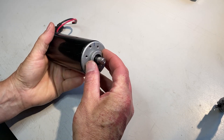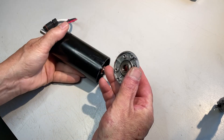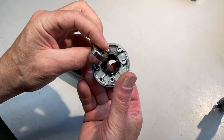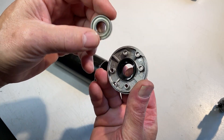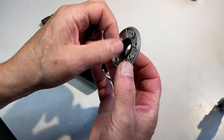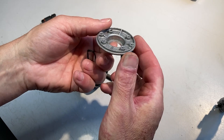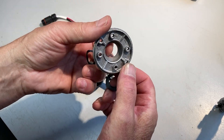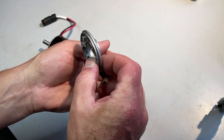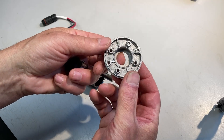I dismantled the spindle to have a look at it and it's not good. It's got one little spindly bearing that has a preload washer behind it that rests against a rubber boot, inside an unmachined casting that's about as thin as a rich tea biscuit. It weighs about 14 grams — the whole thing. It's not very substantial.